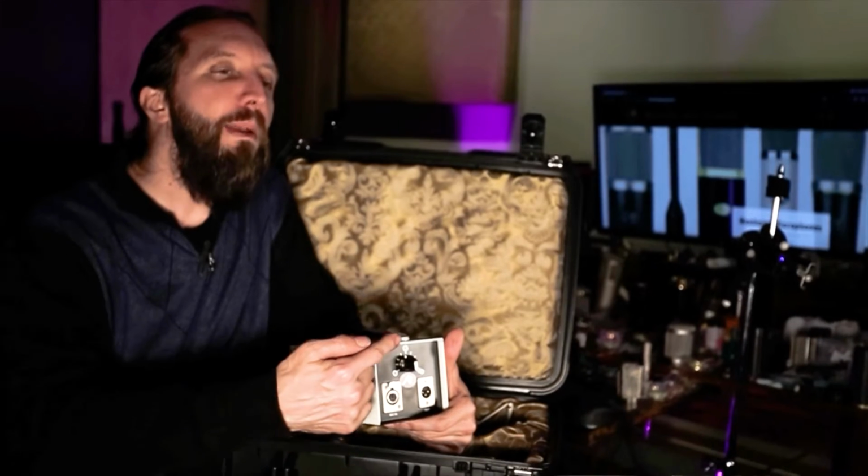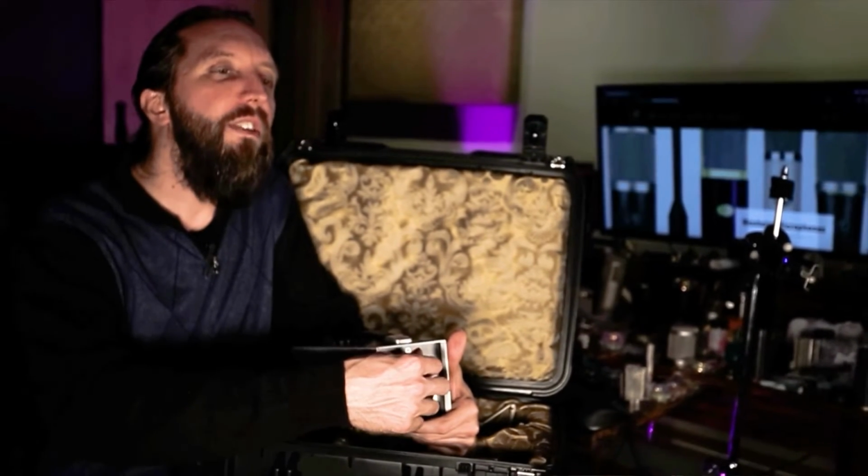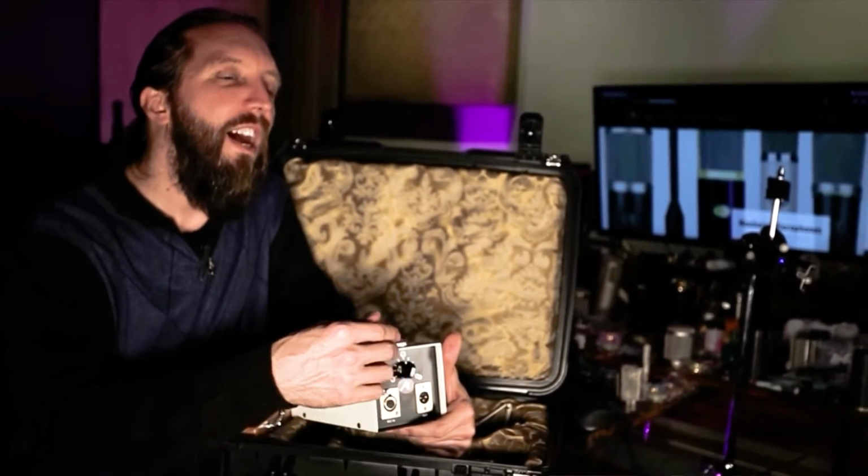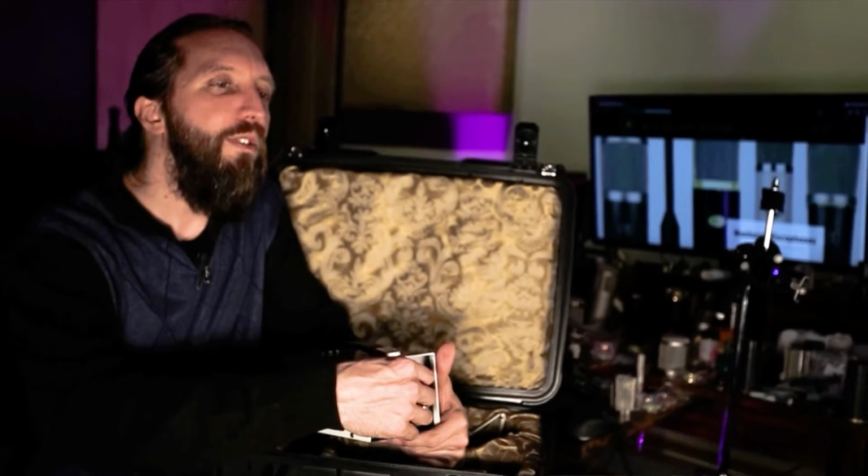Another really cool trick about this polar pattern setting is that I can effectively do vocal stacks or vocal layers by making an adjustment. Maybe I start recording in cardioid and then subtly adjust each layer so that they stack accordingly. I might say a high line might end up in cardioid, and then I might do a subtle harmony or two or three in different settings, and then I'll notice that the stack sits on top of itself a lot more fluidly. And as I adjust the knob one way or the other, I might find a layer or two or three will sit without additional EQ by just rotating the polar pattern switch.